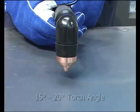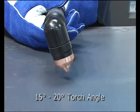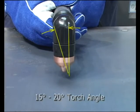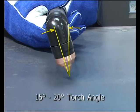To protect yourself during a hand-held piercing operation, angle the torch approximately 15 to 20 degrees in order to direct the sparks away. This technique can often be applied to cutting and gouging as well.